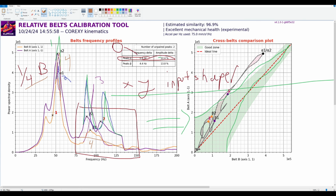And from that, we can then decide whether it's worth doing another quarter turn in B, right? Or sometimes it may be worth doing a half or quarter turn loose in A. So this is a plus quarter, this is a minus quarter A, and seeing if we can't bring this guy back down, right? Maybe tightening B isn't the answer. Maybe it's loosening A. I'm trying to bring A down. So that's it.